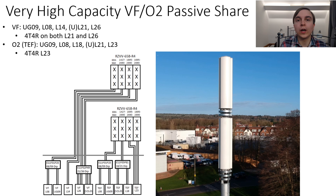The remaining four high ultra wide band ports are used to support 4T4R 2100 megahertz and 4T4R 2600 megahertz. This could be adapted to support 1800 megahertz for Vodafone as well, if one of the paired diplexers is swapped out for a triplexer. O2, meanwhile, existing on the lower stack, would get 800 and 900 megahertz diplexed the same way that Vodafone has. They would then have their 1800 megahertz and 2100 megahertz diplexed together into one set of the high ports, and then the remaining four high band ports are used for 4T4R 2300 megahertz.